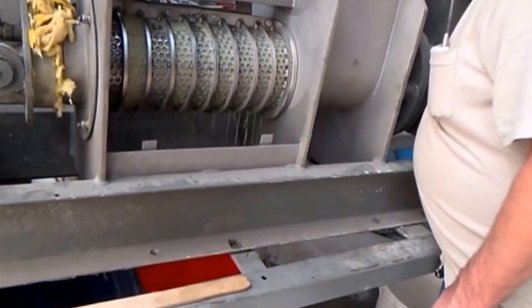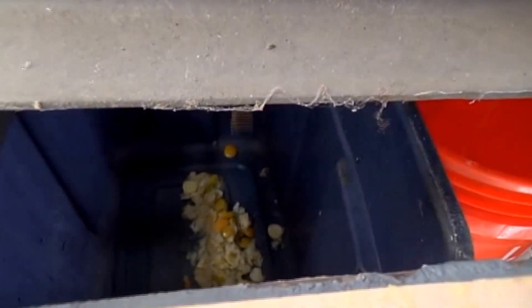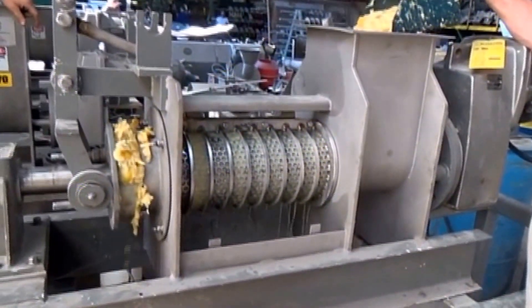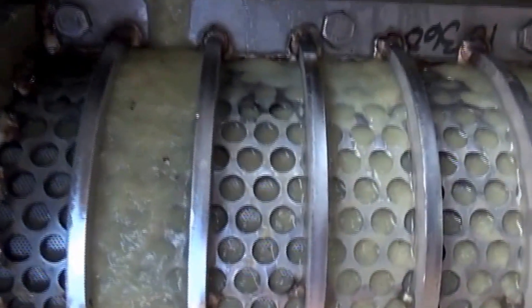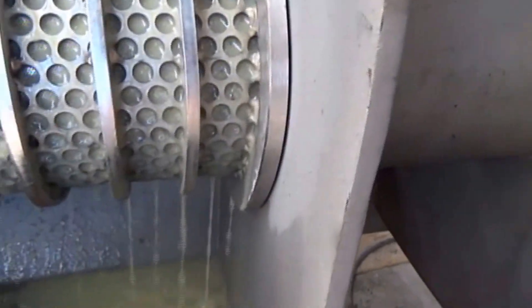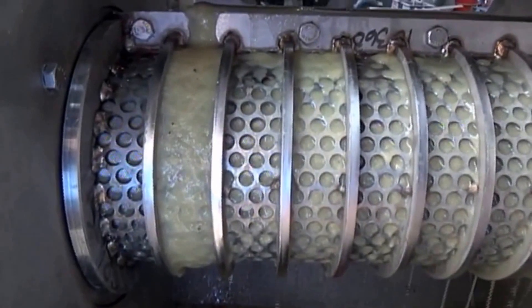We're 36 seconds into our time test. By measuring the amount of pressed liquor that we get and the amount of pressed cake that we get, we get the capacity of the press by adding those two up. We just make sure we stop the test before it starts to run empty. We're getting some puree coming through the screen. This is pretty good liquid — the amount of puree is just a few drops compared to the flow of liquid. So this looks bad, but it may be negligible. You can always blank off that part of the screen.